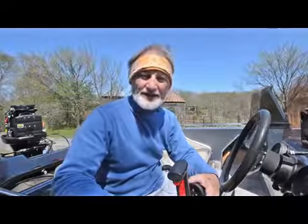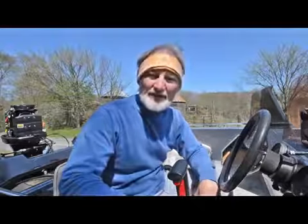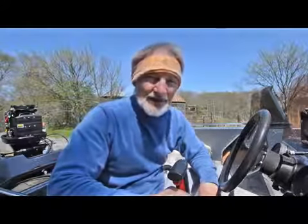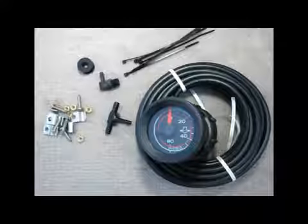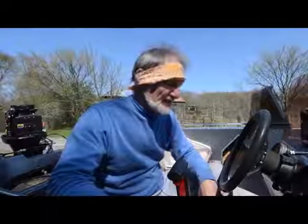One more thing before I button up the big engine. This boat did not come with a water pressure gauge — that's extremely important, probably one of the most important gauges you can have. It will tell you if there's a problem with water circulation before any bells, whistles, or alarms go off. Also, when you're propping out your engine to get the right engine height for optimum performance, you need a water pressure gauge because you can jack the engine up so high that you're not getting enough water — and you can burn up your engine really quickly. So we're going to install a water pressure gauge. I have a kit with everything I need: a water pressure gauge, the hose that goes back to the engine, and all the connectors.